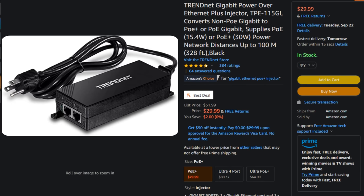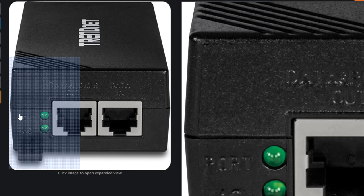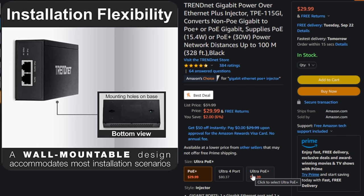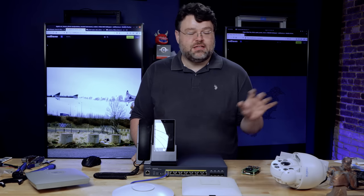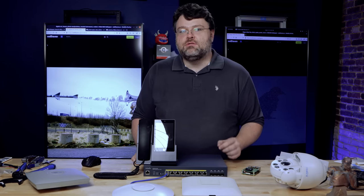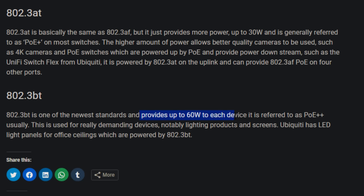It's super easy to find PoE+ power injectors, but a little trickier to find PoE++ injectors, especially Type 4 — that's not really common yet. These standards are: 802.3af (the first real standard), 802.3at which is 30 watts, and 802.3bt which is 60 and 90 watts depending on Type 3 or Type 4. When I say 90 watts I really mean 100 watts — it just depends on where you're measuring.